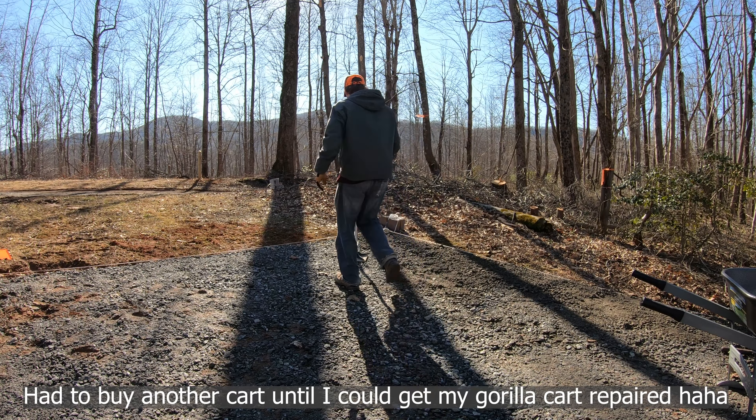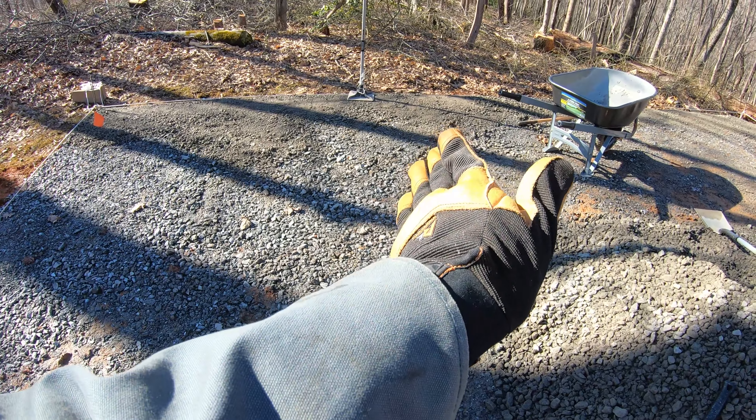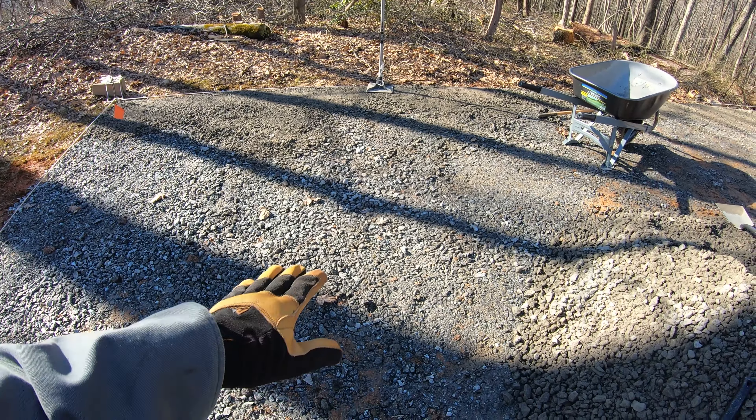It's pretty compact even after just using the hand tamper. Obviously if I step on the edge it will give away a little, but that's why I'm giving it a good two feet of compacted material — the barn is actually going to be sitting back here. It's definitely still pretty unlevel in the middle; I'm going to have to work on flattening that out. When he poured all the dirt in, he threw it in the middle and I had to rake it all out to the sides, so it's probably still a bit high in the middle.